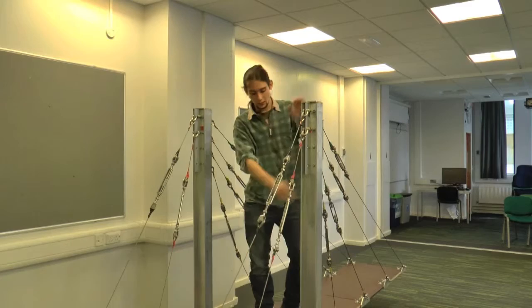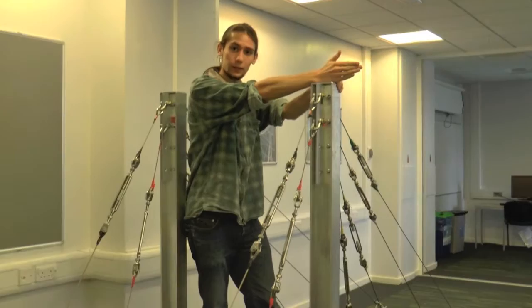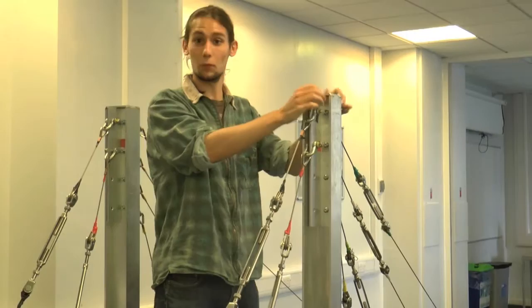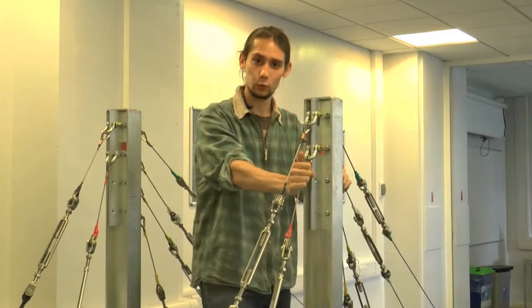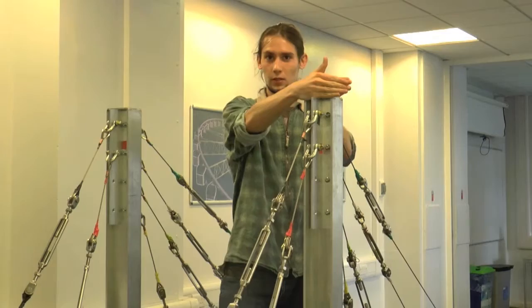Let's look at this column, which is quite interesting because, as you can see, it's an I-section. The slightly counter-intuitive thing about it is that its major axis is oriented perpendicular to the direction of the bridge. This might seem peculiar, but if you think about the loads going through this column, they're actually just pure compression in most cases, because they're just transferring the vertical component of the tension in these cables down to the ground through the column in compression. So from the point of view of the loading, it doesn't really matter which way this column is oriented.